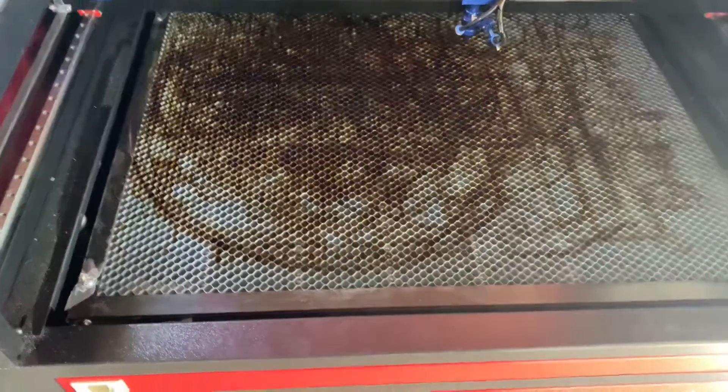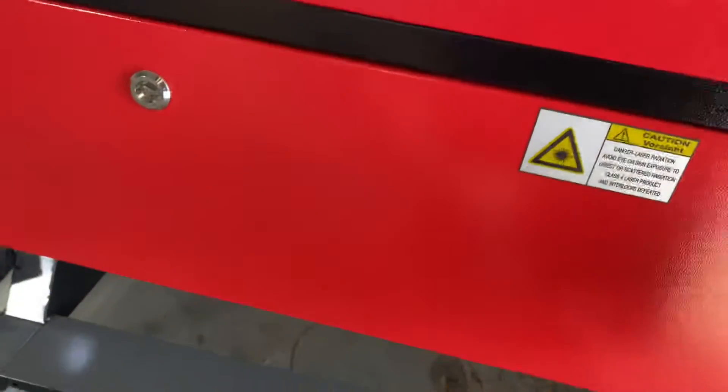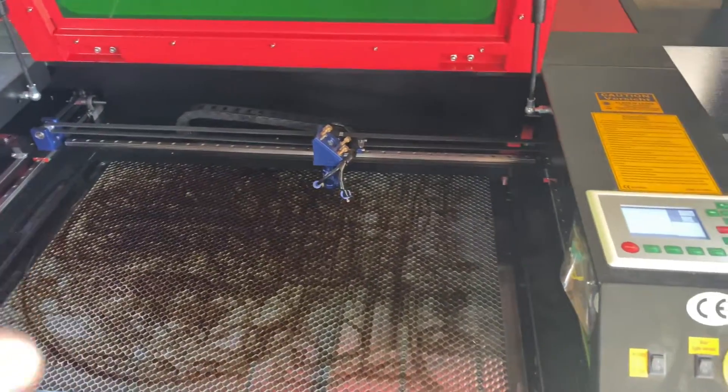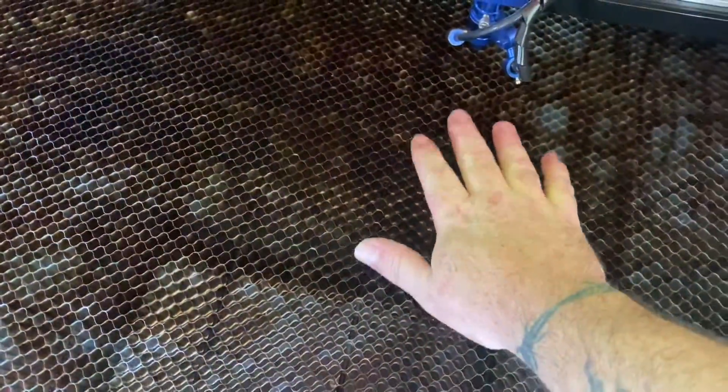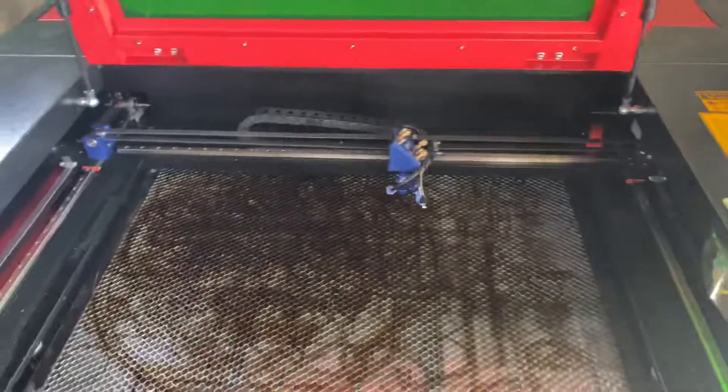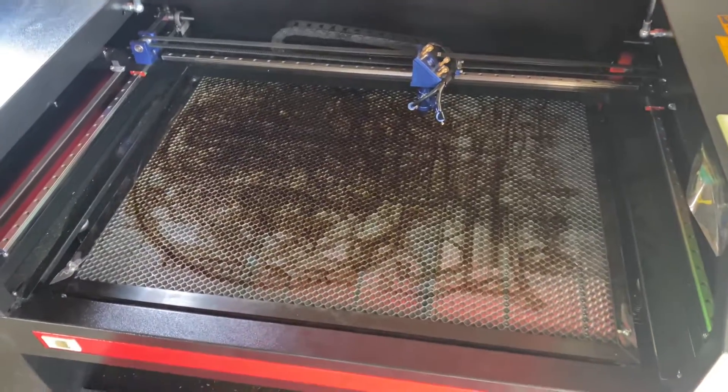I will go through and do it more permanently. I do think there's some adjustment you can do with those bolts rather than just putting something under there. If I can't sort that out I'll probably end up using small pieces of aluminium. It seems to only be a mil or two in most areas, except for the middle where it was dipping down about four millimeters from the top-left corner — and when you're cutting with a laser, that makes all the difference as to whether it cuts through or not. Anyway guys, cheers and thanks for watching.